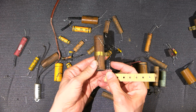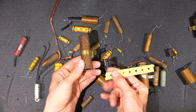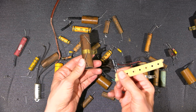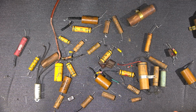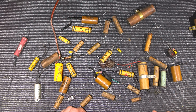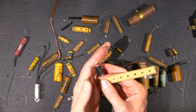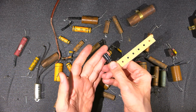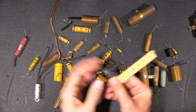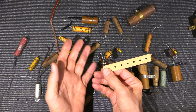You can get these capacitors size optimized as well, and I'm not really too worried about that. These are very long life, high temperature capacitors that I use. So I'm doubting that those will need to get replaced for an extremely long time. Very high quality electrolytics. I have entire lists. I've spent countless hours grading and testing components and verifying them in order to use in these older radio receivers so that it keeps the radio receiver working incredibly long.